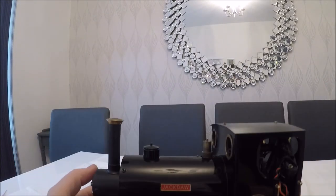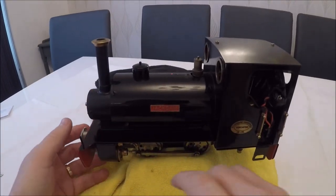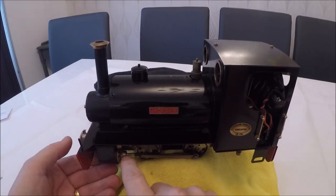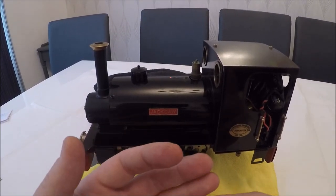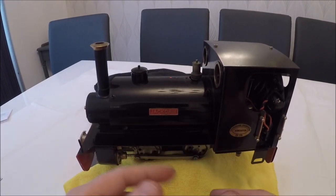Once the cylinders are off, there are a few screws — a couple on the top and a couple on the sides of the cylinders — just to basically separate the cylinders. Then we'll have the new seals; we'll change the seals and the gaskets as we go.